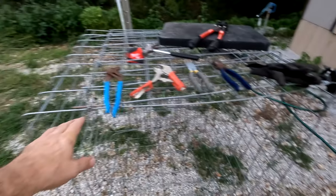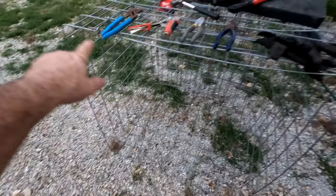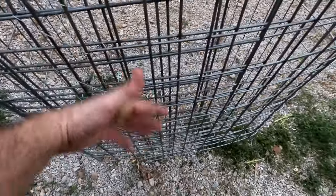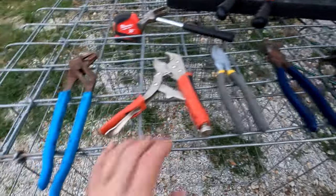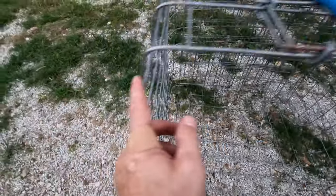We got it done. It can be hard to see with gravel, but it's a 16-foot utility panel bent into 3-foot sections. We folded, cut the edges, and folded the bottom in like you're wrapping a present. To hold all the panels together, we used galvanized fence wire on the bottom. The rocks are going to smush everything together. On the overlap on the side — which is actually the back — we took some corner pieces that we cut out during the folding and got them bent around to lock it all together so it's not going anywhere.